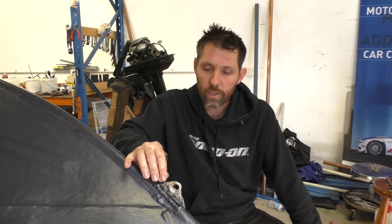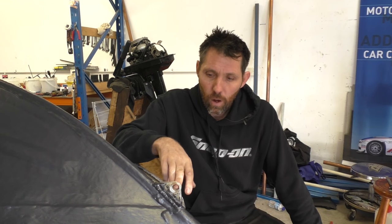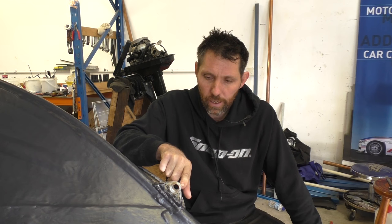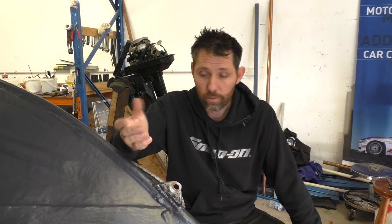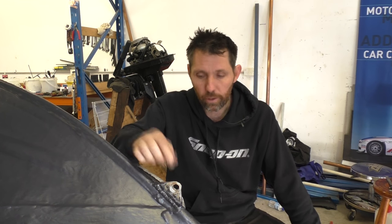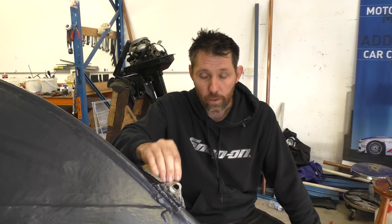The tow-eye here on the green machine is a bit of aluminium plate, about 10mm thick, and I'm presuming it's original. It's quite badly worn now — I'll bring you in closer and have a look. It's always had a galvanised shackle through here, and it's not just how this gets towed to a trailer, because it's almost never on a trailer, but it is where all the mooring ropes for this boat attach. Some at the stern of course, but all the bow ropes attach to this point. So over the years, sitting just rocking in waves, it's worn away the soft aluminium.